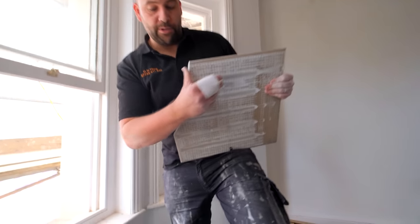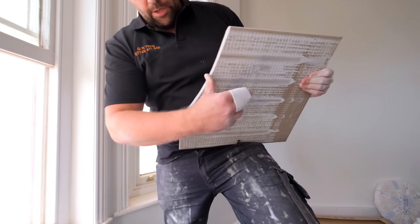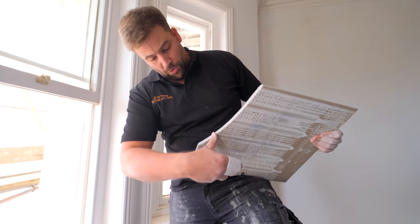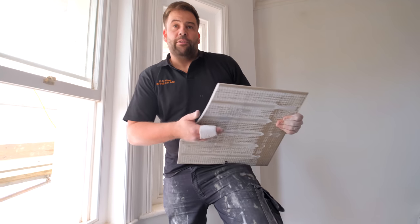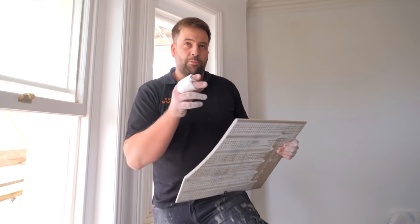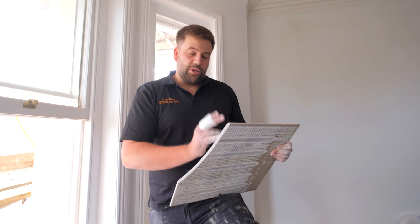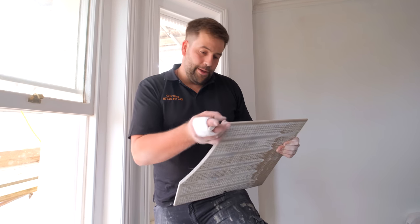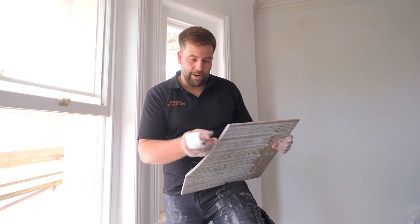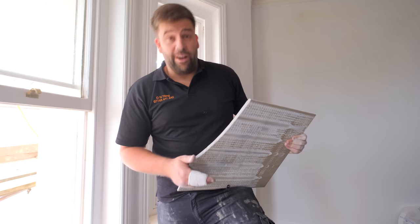Look down the tile, it's a slight back cut to it, which is nice. Always try and get rid of all the snots, so that it is lovely and smooth all the way around there. I've got nothing fouling on the tray because I don't really want it to be fully touching the tray. When you walk on floors, you always hear a little squeak. It's always a tile that, if anything, cuts a little bit too tight. I only leave about half a mil normally, sometimes two. I can get away with that, but that's sort of how I try to do it anyway.